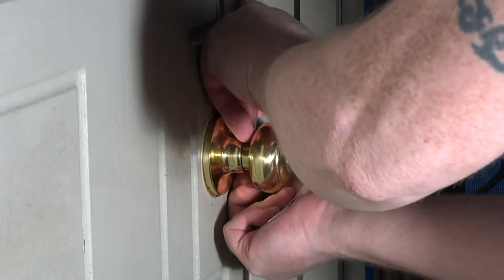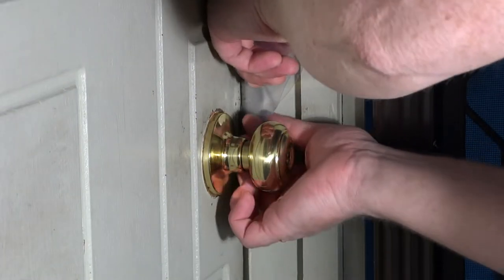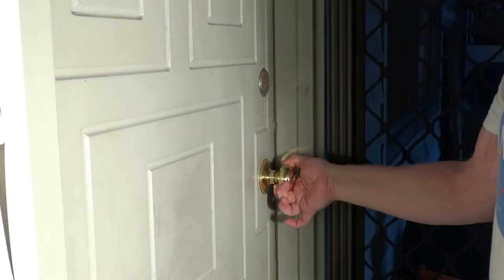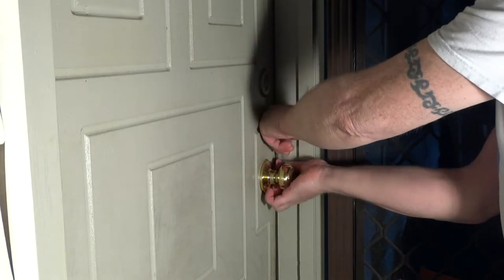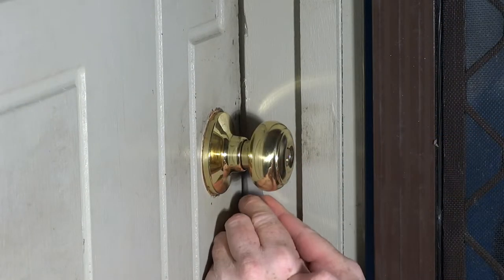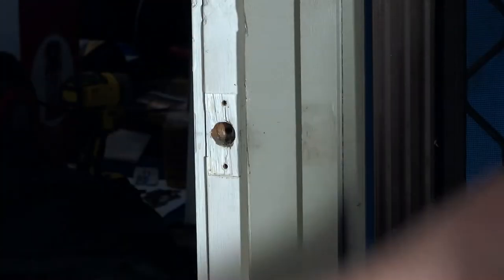The answer is I'm going to use one and/or two strips of this thin plastic. To demo this, we'll just take the strike plate off and that will open out that hole a little bit. So we're outside, we've locked the handle set with the thumb turn, and by removing the strike plate we're simulating a poorly installed handle set where the dead latch plunger is not being retracted. We attempt the shim attack first with one piece of plastic — that doesn't have the stiffness to hold up — so we double it up, coming in at an angle from above and down on the latch, and we get the door open. And we got it open. Our edge is getting a little mashed up, so we take the other end and go down again — straight away in.